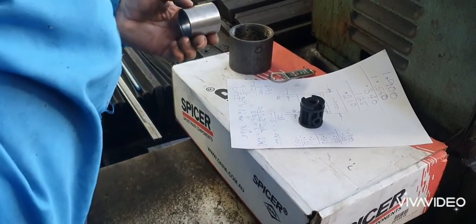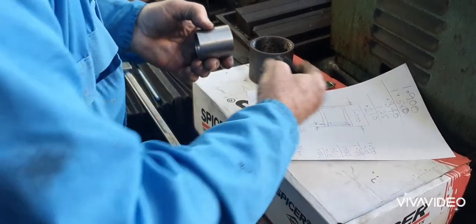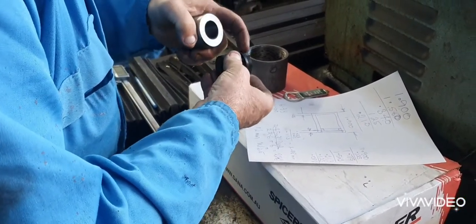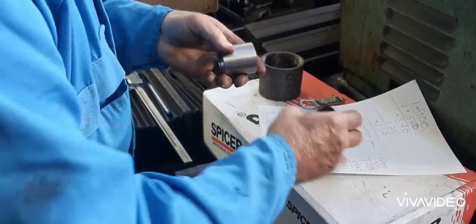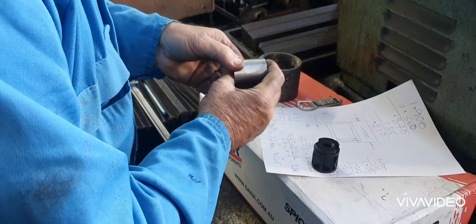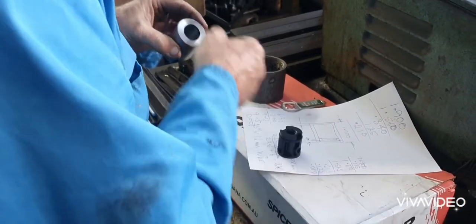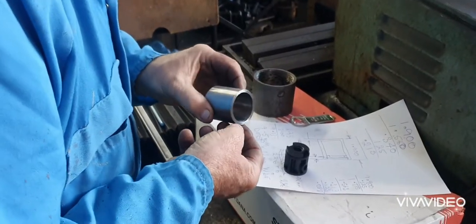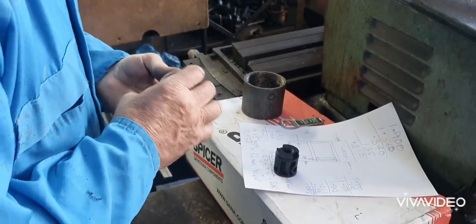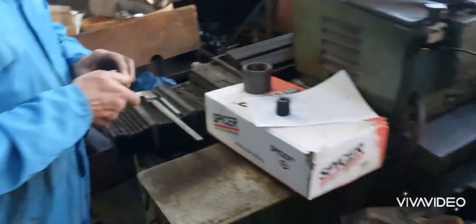And we've got to put it in the vise that way. You run an indicator over the tops of the flat to know whether it's where it is, and then we'll work out where the hole has to go. Anyway, we can just put the three-jaw chuck in there now. I'm going to make a quick coffee, Dad. I'm going to make a quick coffee before all this. Whatever, I'll do the chuck.